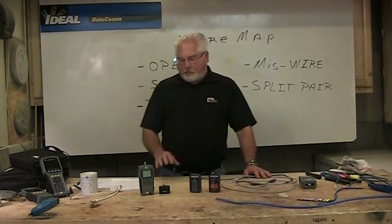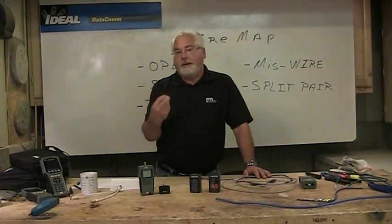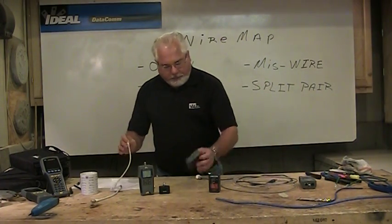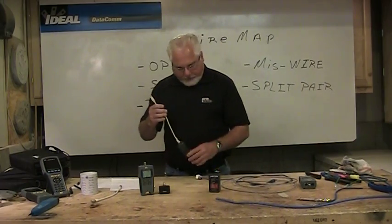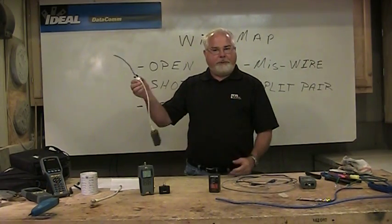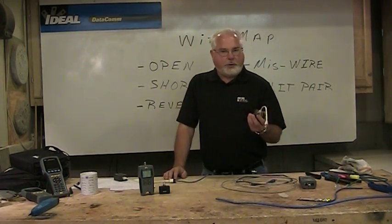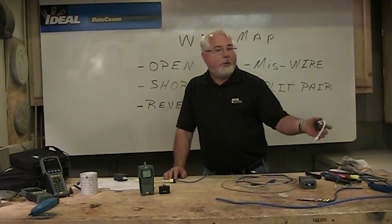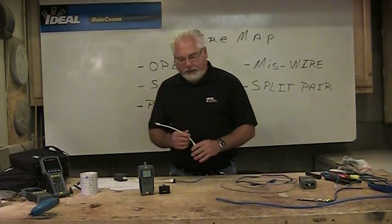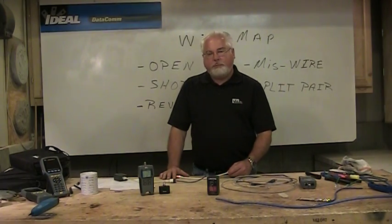So let's take a closer look at these two testers. When you do, you're going to find out that both of these are end-to-end connectivity type testing products. In other words, we've got to plug something into either end of the cable. With one of the testers, you're going to take the remote and plug a patch cord into it. Then you'll have an outlet someplace in a room that you need to check the cabling in the wall, so we'll plug that into that outlet. On the other end, we'll take the main unit and plug another patch cord into it, and then plug that into an outlet in our panel or wherever the other end of this cable is. And so we'll test both ends of the cable with the products. Again, these are referred to as end-to-end connectivity type testers. So again, let's take a closer look at both of these, and we'll give you a little bit more idea of what they do.